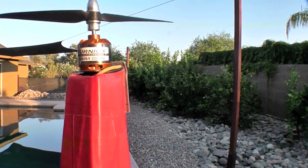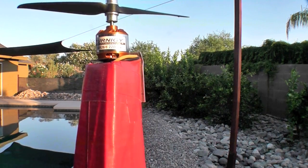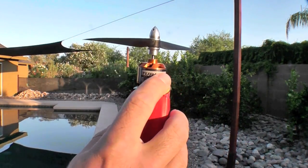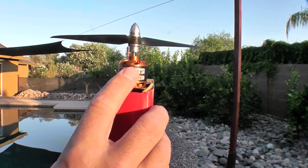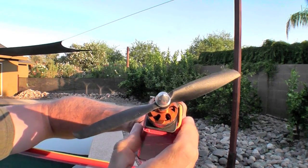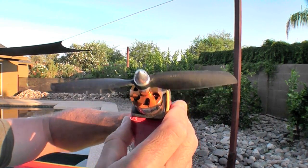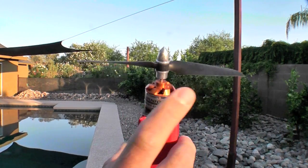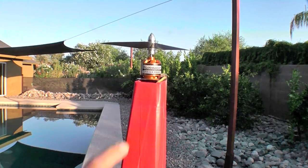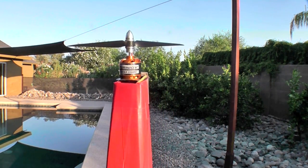The power plant is a little unconventional for a motor glider. It's a Turnigy 2826 x 6 turn, 2200 kV motor. The reason I chose this motor is because it generates a lot of power for a small package, and it does so with a quite small propeller. That small propeller is nice to avoid excessive drag while the propeller is stationary in flight. Another option would be to use a folding propeller, maybe a slower kV motor, for greater efficiency. Also, because this power plant generates quite a bit of wattage, this plane will go really relatively fast.